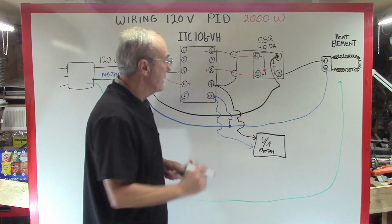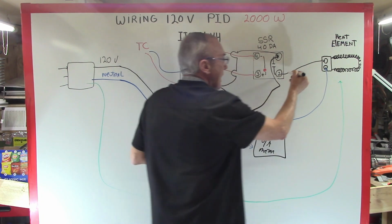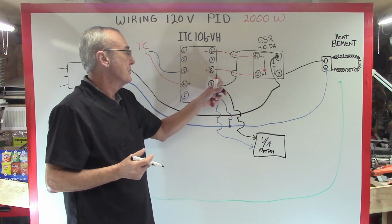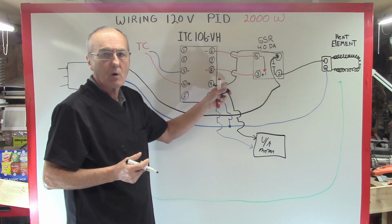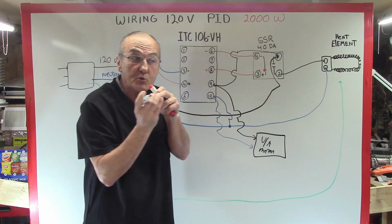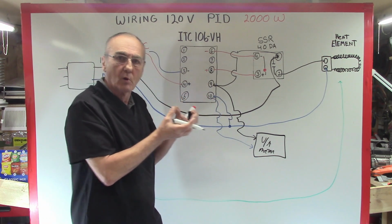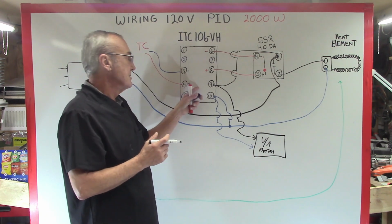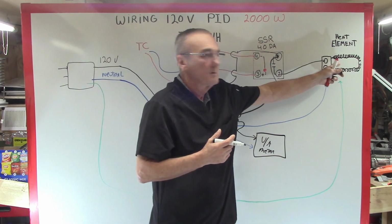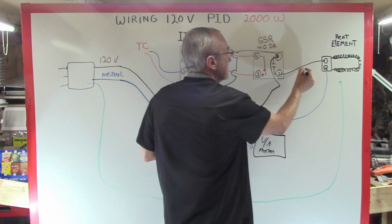So as we measure current, we want to place it around our highest current carrying conductor, because that's the one. I'm not really concerned with what the current is here, because I know that this is low current. It's the draw and requirement. Remember, current only flows through a conductor based on what the device requires, is pulling for, drawing. And this is so low, I don't need to know what that is. I'm concerned about what this is. So it goes around one conductor, your donut.